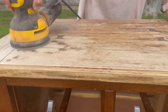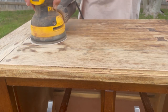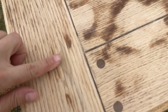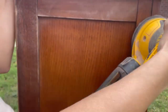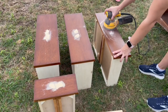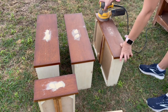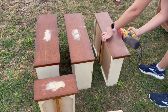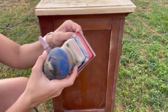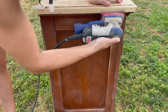The finish on the top of both of these nightstands was failing, so I knew I had to remove the finish. I was planning to sand the top down to raw wood and stain the tops, but I burned through the veneer in a few places and decided to paint the tops instead. I gave the body of the nightstands a good scuff sand with 150 grit sandpaper — doing a scuff sand gives the paint some good teeth to adhere to. I then got my surf prep sander with the foam pad attached and sanded the detail parts that my orbital sander couldn't reach.